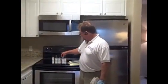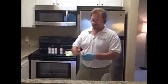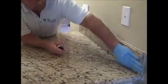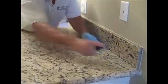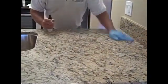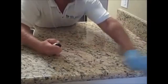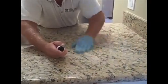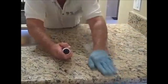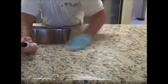Now we've finished with number three, we're going to go to number four and do the same procedure all over again. Make sure your countertop stays wet during application, because when it starts to dry it's time to buff. You'll know it when you look down in the light and see the sealer half dry. That only takes about five minutes or less, depending on humidity and temperature.